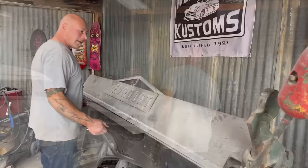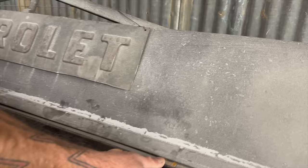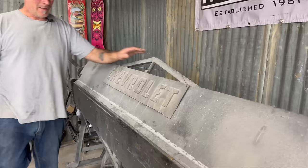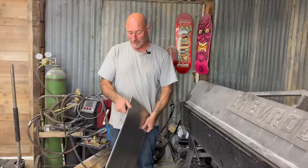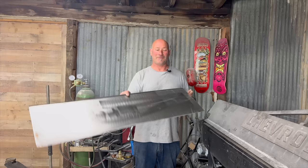What I always do with this brake is it's not perfect — it's not perfectly straight. So I just center myself and the material on it. I know from habit that this lip here is just about five-eighths, so I want a half-inch hem — I'm just eyeballing it because it's not important, it's under the car. As long as it's even. I'm going to shut that and close this pan all the way to this angle, and that's where we're going to finish. Nice push right into it. It's nice and straight. Cool — that's the first step.